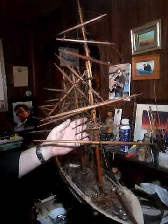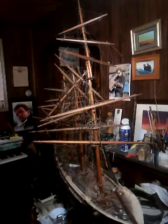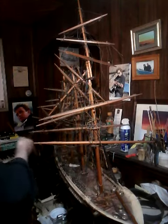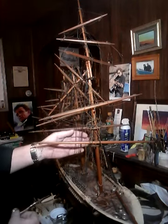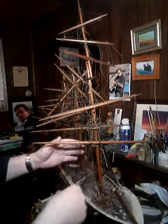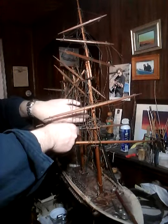That opens up all of this. Is that running rigging? There's been some repairs done — you can tell in the standing rigging. People have done repairs because they use the wrong line. These shrouds don't match. The lowers are entwined, and I'm of the school of thought — I'm going to cut that away. We're going to replace them. I'm going to leave a little hanging in there.